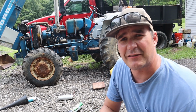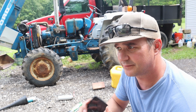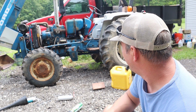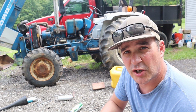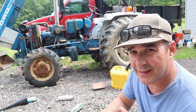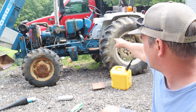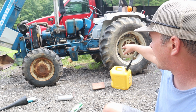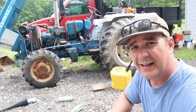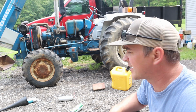Well, that's not what I was expecting. I kind of thought this clutch was frozen. The clutch was frozen to the flywheel, but must have broken free and get it into first, second, third, reverse in one, in the range of one, I think, if that's how you say it. Actually, I think I'm just going to jack up the tractor, and I'm just going to move the wheels back and forth because it seems like the shifter for the ranges is stuck.